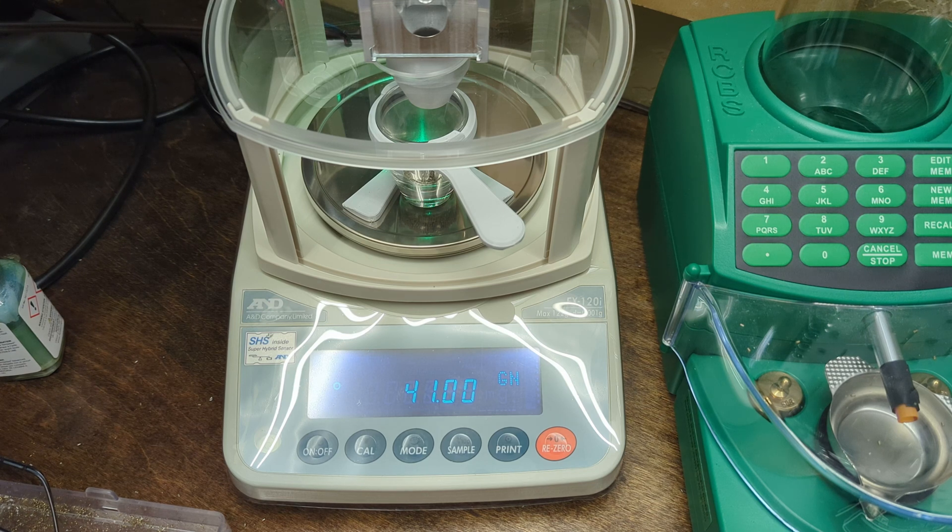It's still a much lower standard deviation than the RCBS, and it ran quite quickly. With a little tweaking I could probably keep most of that speed and recover the precision to avoid those higher drops. Tuning definitely gets you speed. Whether you always have to give up precision — maybe with more playing around I can get the standard deviation back to 0.02. Saving five to ten seconds per load is great, but the stock settings with only that small time cost were already delivering about as much precision as you can hope for. So those are the trade-offs.